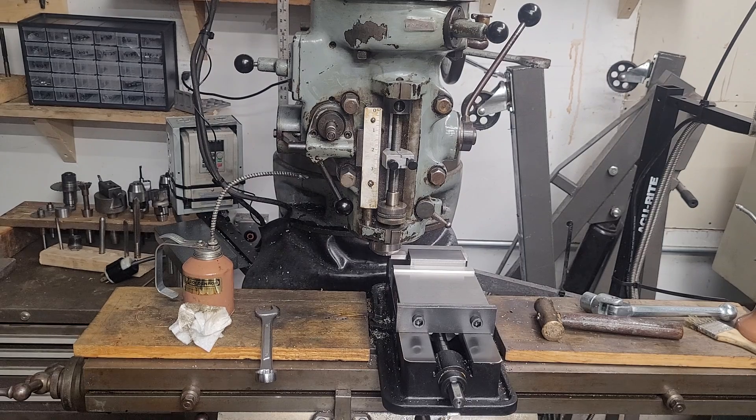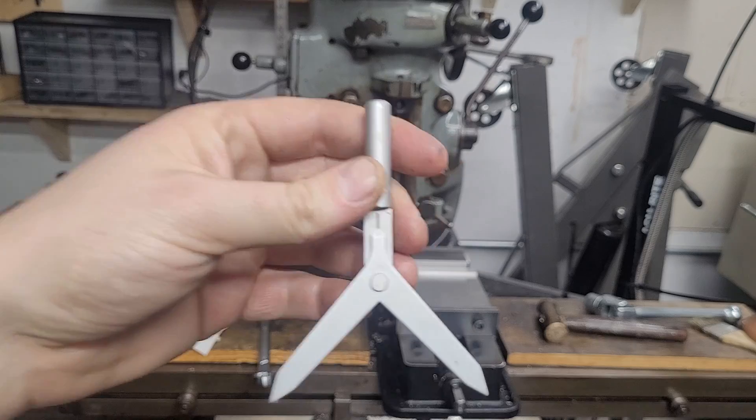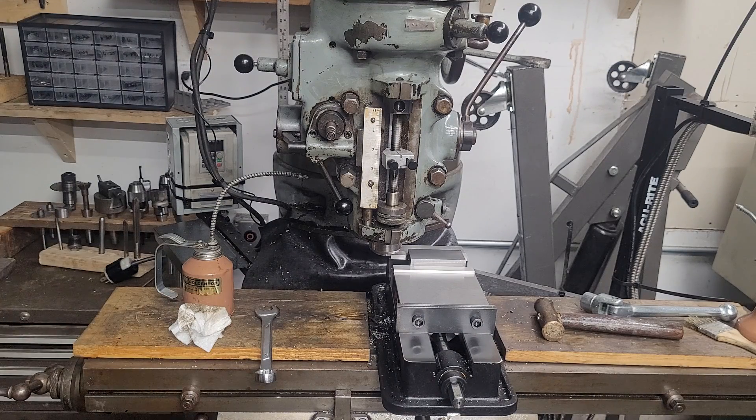This one — I don't remember who makes it, but I bought it from McMaster-Carr — is really nice for finding the center of a rod quickly. You just go until it lines up. It's not perfectly precise, but it's quick. I see guys on YouTube using the scale trick all the time. I don't really like the scale trick to find center — one, it's hard on your scales; and two, it's really not that much more accurate than, frankly, turning the machine on and running the spindle down while moving back and forth. If you're gentle on it, you can get yourself within 5 or 10 thousandths of center pretty easily and quickly.